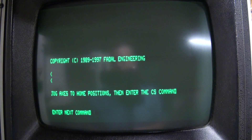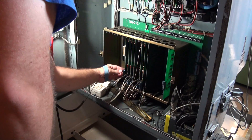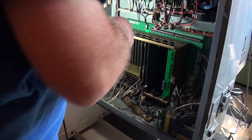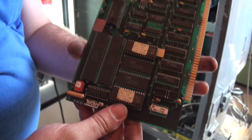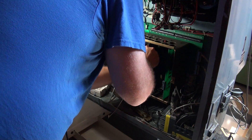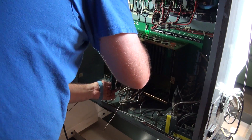We'll turn the machine off, go to the back, pull the old cards out, and put the new cards in. The procedure for each card is the same — remove the card gently, put it in a static bag for transport, and repeat. We pulled out the processor board, then the video card, then the computer interface board. Some of them are in there pretty good. Next were the X, Y, and Z axis controllers, then the A-axis controller card — I have a fourth axis — then the spindle card. You can see it says 'rigid tapping,' which is how you know your firmware is capable of rigid tapping. On the Dash-4 boards, the spindle controller has a couple more chips. After the spindle card come the clock board and the mill interface board. Then we did a whole bunch of cleaning and got the cabinet quite clean with the cards out.